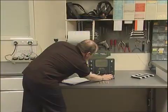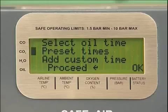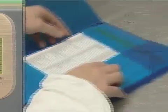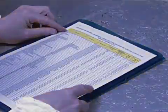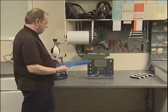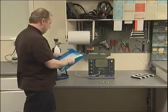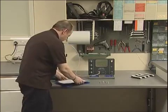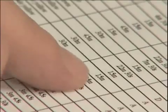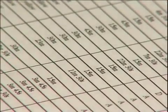The oil time must now be selected by entering the preset times menu and using the up and down scroll buttons. The oil time is selected to correspond to the particular type of compressor oil that could be present in the cylinder being tested. This information can be found in the documentation wallet and is updated regularly on our website. The tester is programmed with four pre-set times, which cover the vast majority of compressor oils currently available. In this example, the oil is known to be Anderol 555, with no risk of cross-contamination from other oils. Consequently, the 15 minute preset time has been selected.